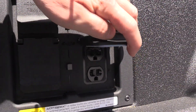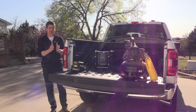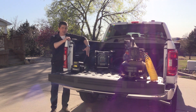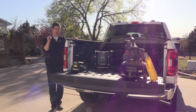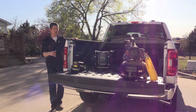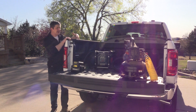If you have the 7.2-kilowatt setup, keep in mind the capacity is up to 6 kilowatts — or 6,000 watts — for your outlets. If you're just using the four 120-volt outlets below, you're going to be maxed out at 6,000 watts. To get to the full 7,200 watts, you're going to have to use that 240-volt outlet. So if you don't have something plugged into that 240-volt outlet, you're probably maxed out at 6,000 watts.